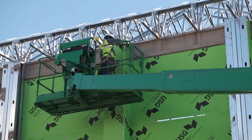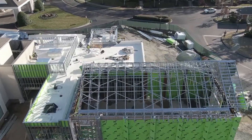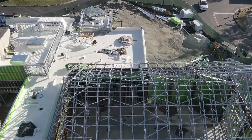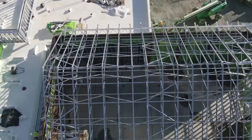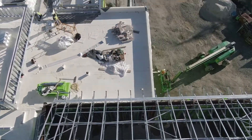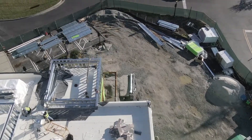With that in place we can start weatherproofing the building. You'll notice the flat roof has been completed, and once the flat roof was completed we had to tie in the roof drains to make sure it didn't get water inside the building. We put in some temporary measures with drain tile in place that drain outside the footprint of the building so we could continue work inside while weather is going on outside.